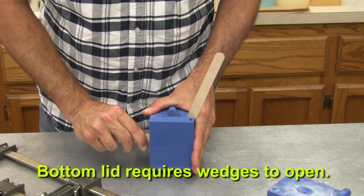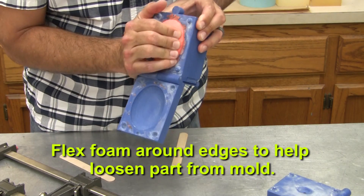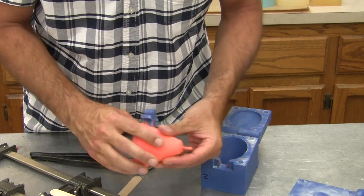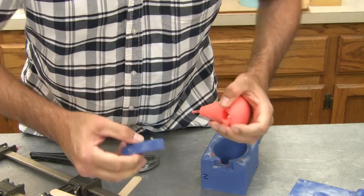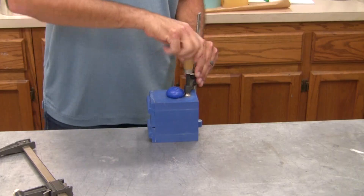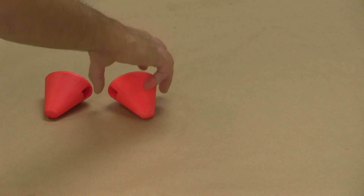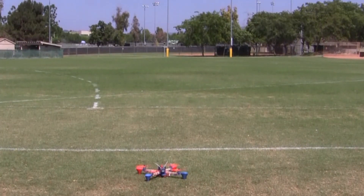20 to 25 minutes later, we're ready to demold the part. Remove the overfill at the vent and begin to open the mold lid. The bottom lid requires some wedges to help pry open the mold flange. Once the lid is open, push around the edges to start loosening the foam from the mold. Our mold insert helps in getting the foam pad extracted the rest of the way. Continue to squeeze the foam around the insert and slide it out using the molded hand grip. A little cleanup to remove flashing is all you need before it's ready for the quad. Casting foam pads in a different color is easy by substituting a different pigment. Now that we've cast several pads, we can start to assemble our quadcopter. Check out the part 2 video to see the quadcopter assembled and fly. Thanks for watching.